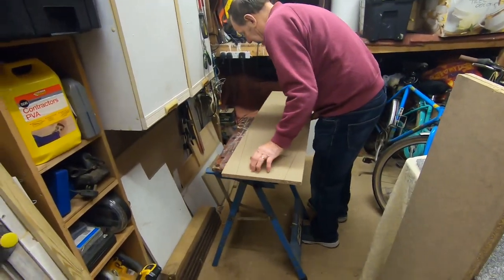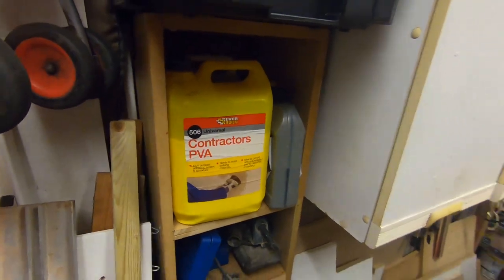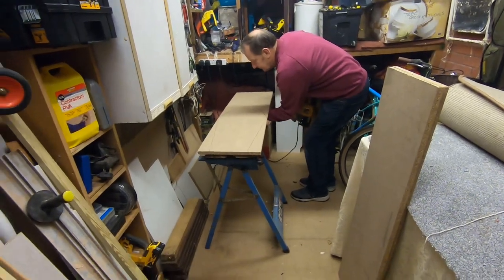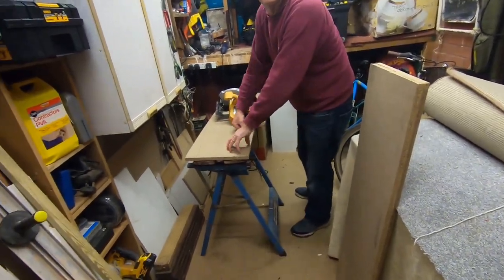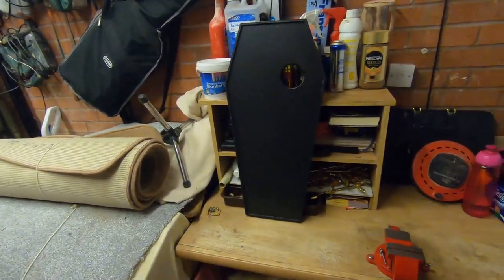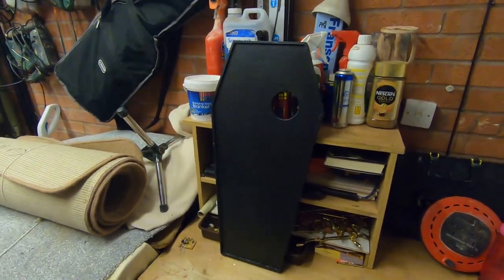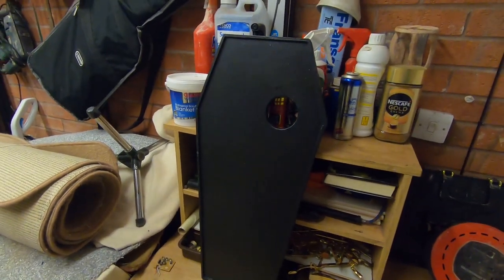Now with this chipboard you do have to seal it with a contractor's PVA — add a little bit of water to it just to thin it down, and a couple of coats of that. Then I'm going to be using Dulux black paint, and then a sealant, because even though this is not a bath tray I'll still make it waterproof. If you're going to use this as a tea tray and you spill water on it, you don't want it to be absorbed into the wood. It's a black matte paint — that's important. I did do three coats of black matte on that, so by the time this is done for the giveaway it's going to be immaculate.